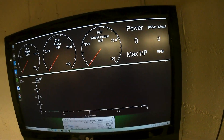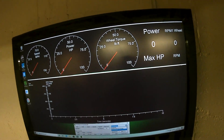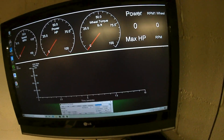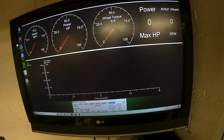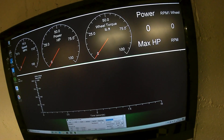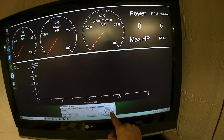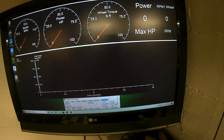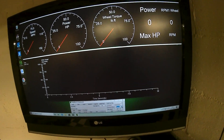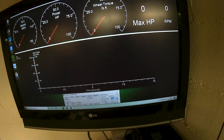I've got it set to comport for the Arduino, but you can actually run this software via an audio cable with a pair of headphones - when you download the software it comes with a manual online. I didn't know how to use any of this; I had to sit there and read it for like a week. This is the baud rate - the Arduino is programmed to run at 19,200 baud. The faster you have the baud rate, the more information it can carry. I set it at mid-range to get it working and then tweak if needed. When programming your Arduino the software tells you what baud rate to put in.